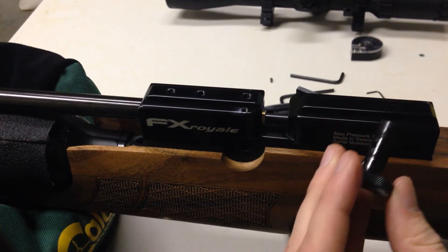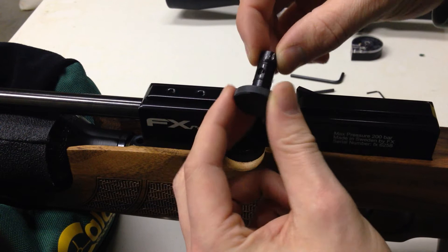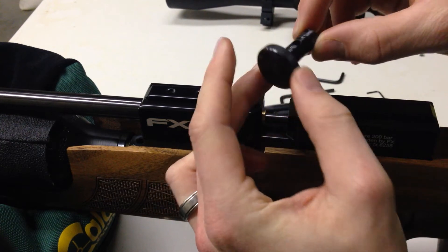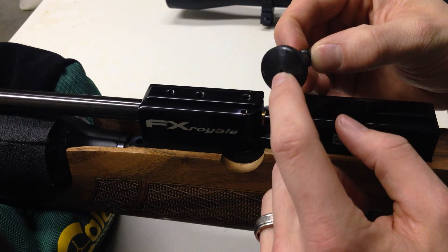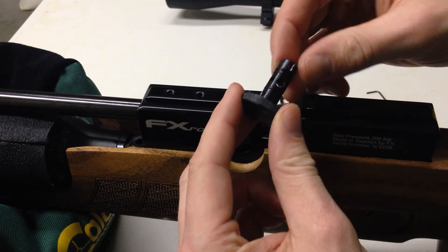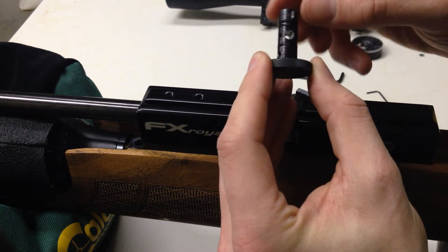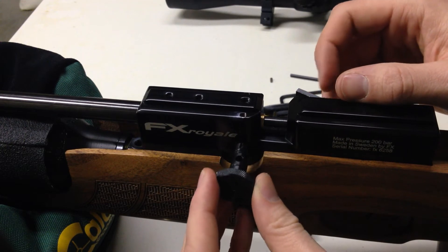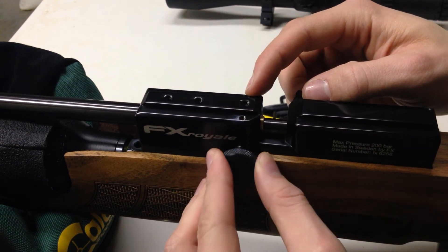To reassemble, you just put it back in in reverse. If you want to actually take these two rotating pieces apart, you would remove the center Allen screw there, and these two pieces then become free. I've also found that if you over-tighten the center screw when reassembling, these two pieces will not turn. To reassemble, just line up the slot to be vertical — it doesn't really matter what orientation the hole is in — so you just want to make sure this slot is faced up so it'll align with your locking screw when you slide this back in.